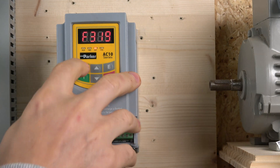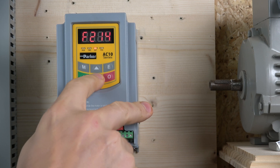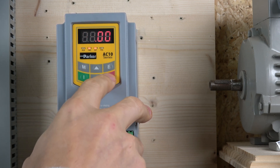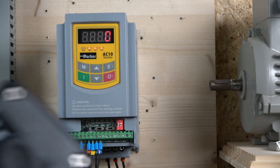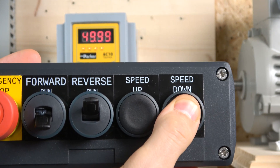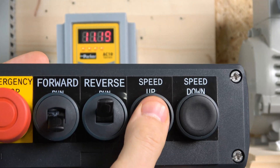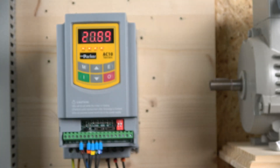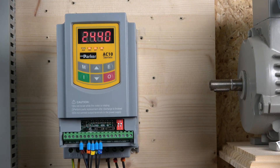Let me show you quickly what happens when you change parameter 211. We change that one, then going down to 11 - enter that. Now let's go up to about 20, enter that one. Watch how quick it goes - see how quick the speed went up and down. That's how sensitive you want those buttons to be, and it's set in parameter 211. And that, ladies and gentlemen, is how you get your MOP control, or up/down speed button control. That will be enough for this station - let's jump on to how to set up the multi-frequency.